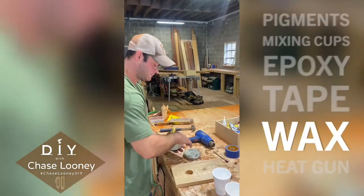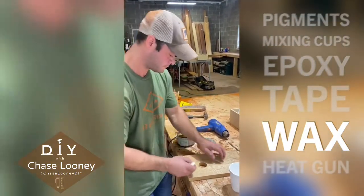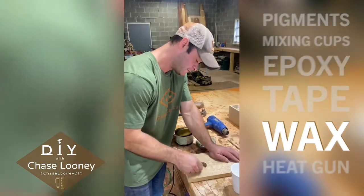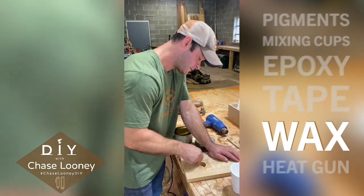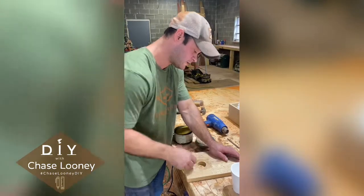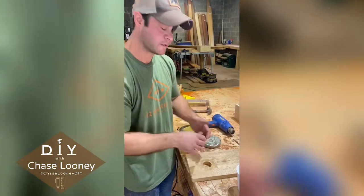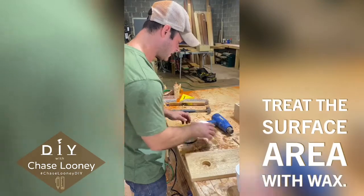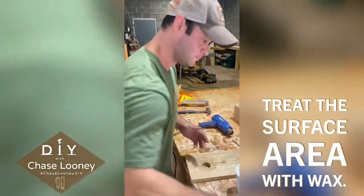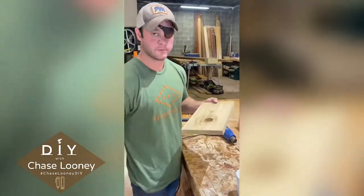wax. It should be in every shop, every house. It's very important. I'll actually put wax around this hole, and what that does, it keeps the epoxy from actually curing and setting onto your finished product. Makes it a lot easier. You can actually chisel it up, it'll pop right up, sand right off. So I treat the surface area with wax, and then if I pour epoxy in that, it's going to go right through it.